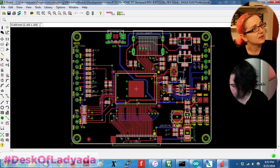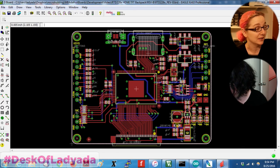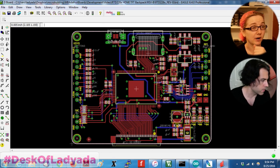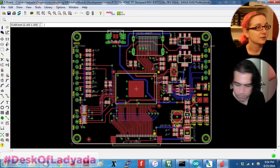I think so. The epoxy that they use for wire-bonded chips directly on board is basically the same as whatever is packaged with chips. It's the same material. Usually people actually grind it off. Acetone? Acetone is not going to take that stuff off. You need something way more vile. It's epoxy, basically ceramic. It's tough stuff, and once you dissolve it, you usually destroy the board.